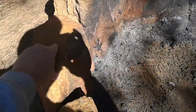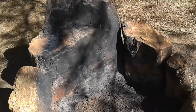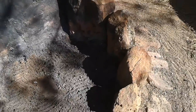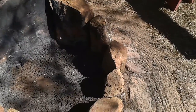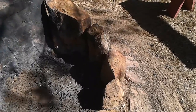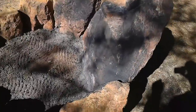The trick to this thing is that with any of these rocks you basically have to go one-third of the distance into the ground. So this big rock back here is probably two feet into the ground, and this one is probably 18 inches or more down below. You've got to get big enough rocks that you can get them down into the ground. Just dig your hole out, line up your rocks, take smaller rocks, pack them in around the bottom, jam them in — I used a hammer or sledgehammer and beat them in until everything's tight. Then you just take your dirt and a hose and wash the dirt down into the cracks until everything's filled up.